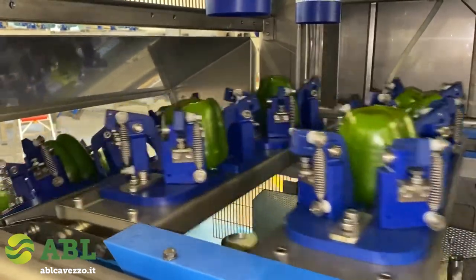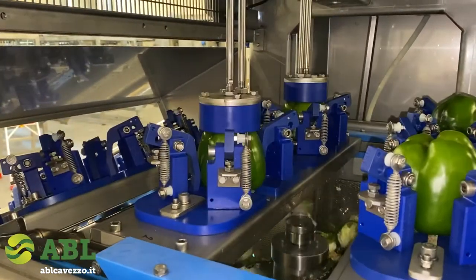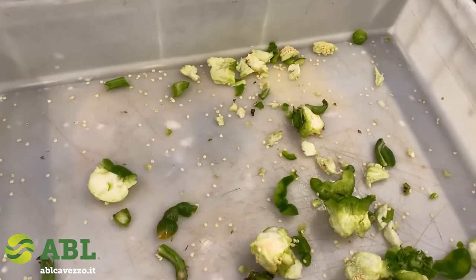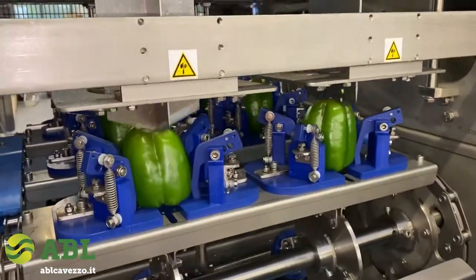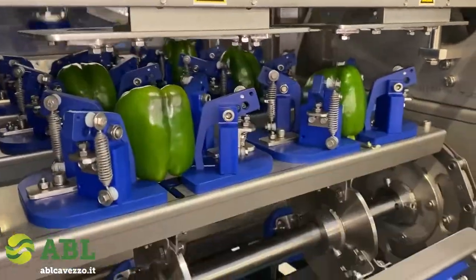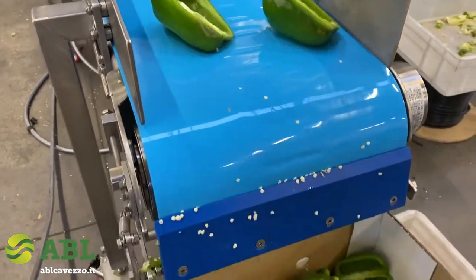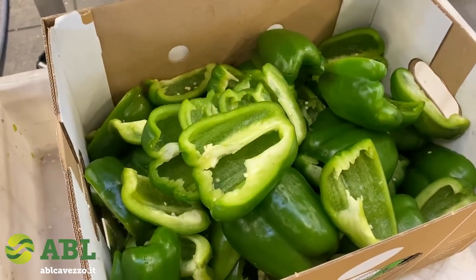Normally it is not possible to see how these internal features are working from the front of the machine. The two parts come inside on a separate rail, so the waste is also separated from the product. The machine is equipped with cups that carry the product along the rail. Here is how the product comes out — inside the core tube, we have a spray system with air or water that removes the seeds from the product.